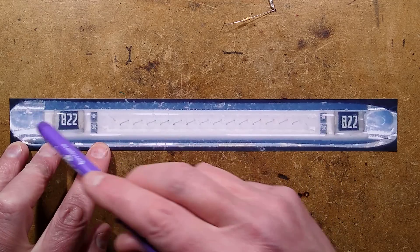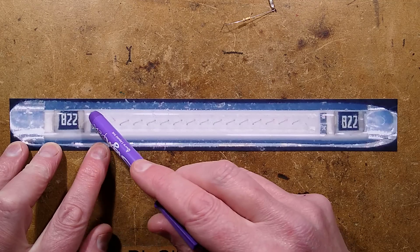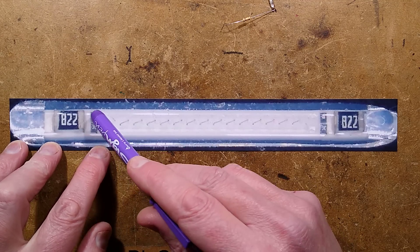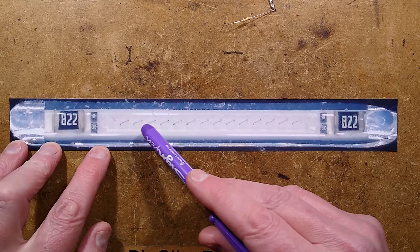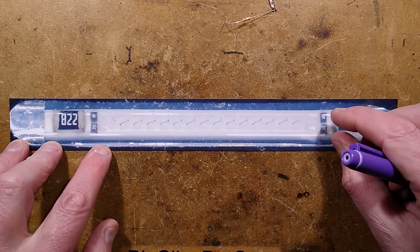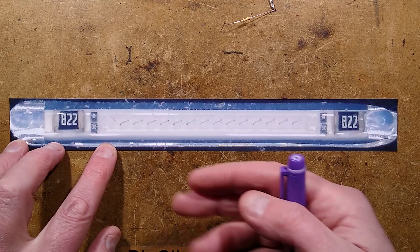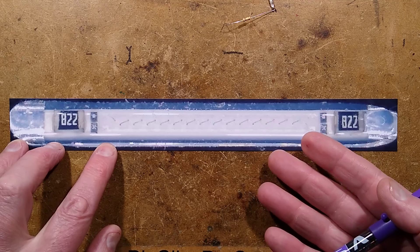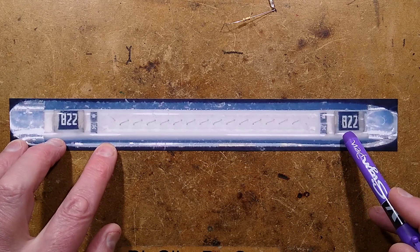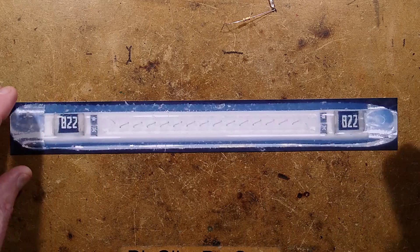So what do we have? In each of these filaments, we've got a crimp end connection, an 8.2K resistor at one end and two diodes - bare diode chips basically just bonded onto the circuit board material - and then a couple of bus bar rails going down, and then there are 15 LED blocks. But it's not simply 15 LEDs. There's a couple more diodes that effectively form a full bridge rectifier, and then another 8.2K resistor. The dissipation of these resistors - initially I thought these might be single 3V diodes but they're really not; they're 18V each. I've estimated that the dissipation is approximately 70mW per resistor. The whole thing runs fairly cool.